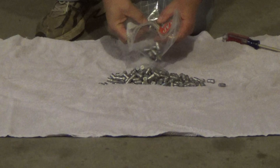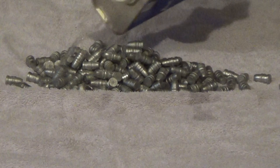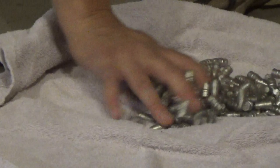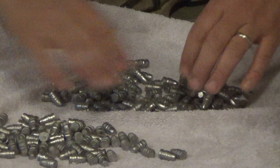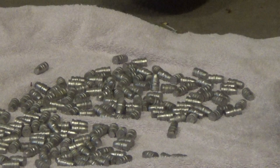We're going to do this much like moly coating. First step, the lead bullets here — we're going to wash all the oil off of them. A little acetone here, a little sprinkle. Make sure you're in a well-ventilated area. That ought to do it. Put it in there to the dry spot, then try to evaporate out a little bit. I know I have oil on my hands, but I don't think that's really going to hurt it any.